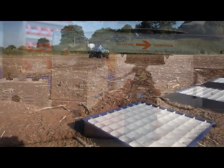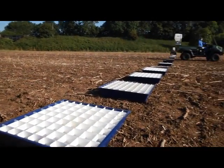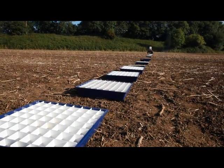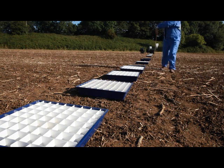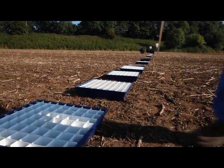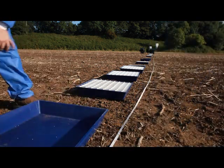We are now showing the EBC TFL120 model series, which is the high-capacity motor suitable for larger machines including the UTV shown here. We have calibrated this to spread the ESP slug pellet at a rate of 5 kg per hectare, at a speed of 15 km per hour, at a width of 24 metres.